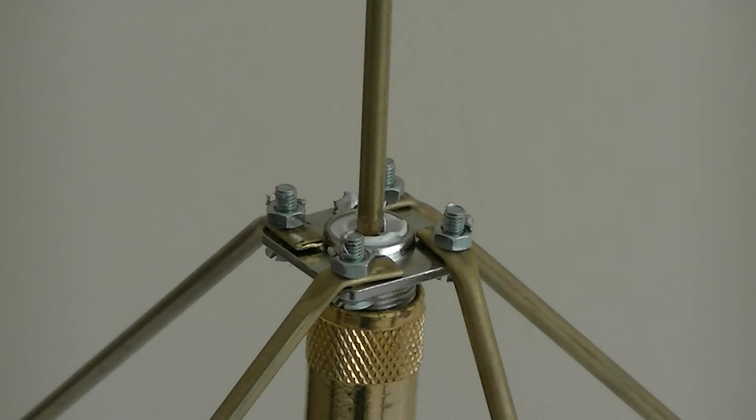It's a very simple and quick way of making them. Now I flattened them and they were good, but it's making the holes that you have to be wary of. I bought the 4mm ones — you can buy one 4mm brass tube then go for the larger for the ground planes, so all you need is two of them. That's if you want to do the drilling through the centre. You can do that if you want to, if not you don't have to — you just drill a hole straight through the tube and mount it on without compressing. Either way it's up to you, but that's how I made mine and it looks quite well.